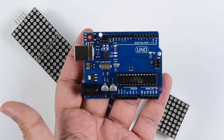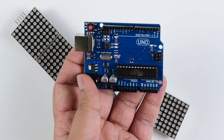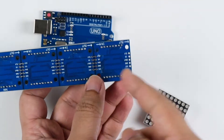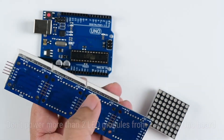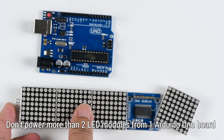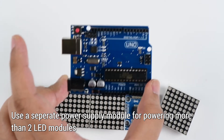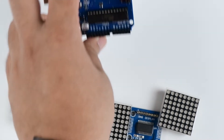Each of these pins is only capable of providing 10 mA on their own, so sending a signal is not a problem at all. But if you're thinking of powering the entire board, I would say stick to just one module. You can detach or saw off a single module and power that with one Arduino board, or push it to a maximum of two modules with an Arduino Uno. For more than that, I would suggest getting a separate power supply module.